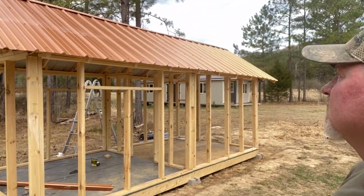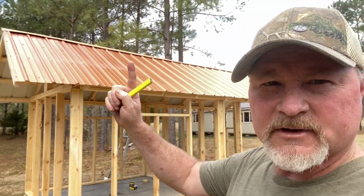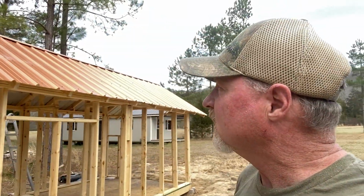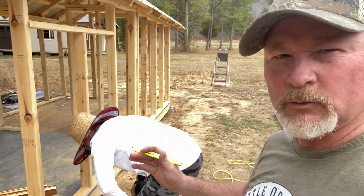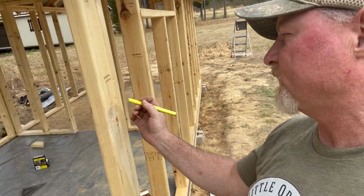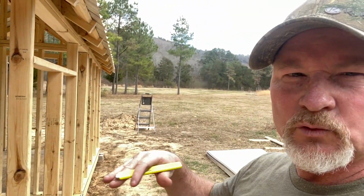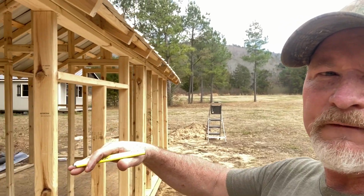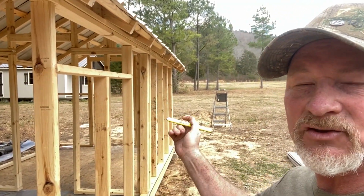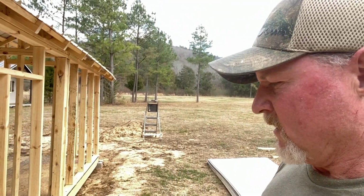All right. The roof is done along with the top ridge cap. So that's complete. So here's the plan on the siding. We're going to start putting up the siding over here. And what I want to do is I want my 4-foot to break at a certain point on here to where all I got to do is rip another piece and it will fill in. 3 pieces should then fill in one side as a 4x8 sheet.